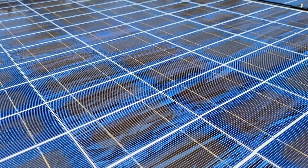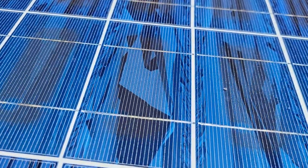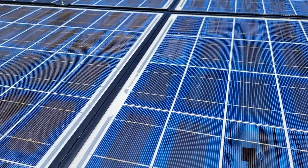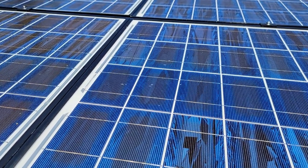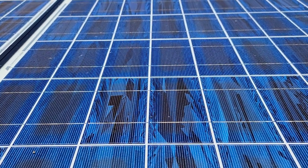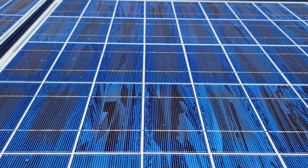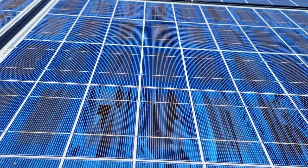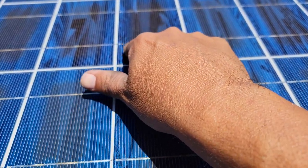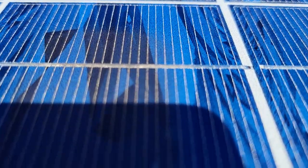Could be a Dawn soap or detergent or anything — who knows what they put on these. As you can see, the cells — this is what they're going to look like. So if you are a customer or somebody watching this YouTube video, this is the reason why you don't use hard water or any type of detergents on your solar panels. Because after a while they start to form like that, and then they get to the point where they get really bad and form like this. As you can see right here, this little line is already deteriorating.